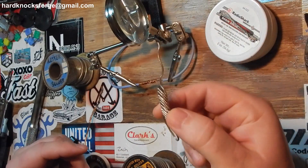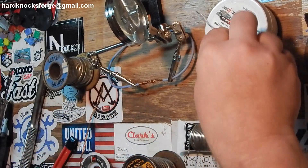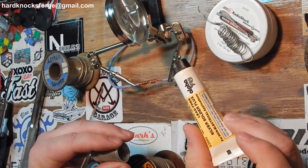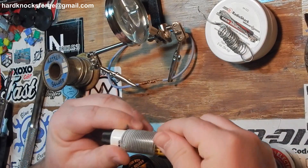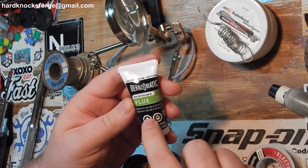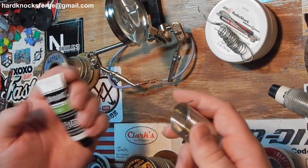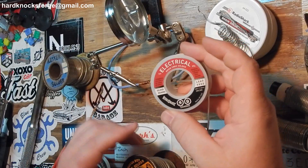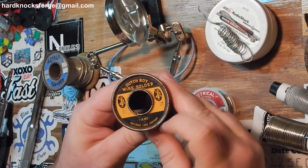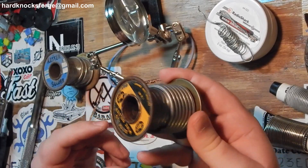This solder all came with that Weller kit, so I don't know exactly what it is. I'm guessing it's probably rosin core, which means it has the flux built right in the middle, and it's probably tin and maybe a little bit of silver. But there's all kinds of different types — there's lead-free silver solder. Some work better with soldering irons and some work better with fire. This here is a Bernzomatic — it is made for flame. Just good old electrical rosin core solder, lead-free silver bearing. Then you get the old school stuff — the Dutch Boy — it actually is leaded solder. This stuff right here is great, the best stuff in the world for wire.